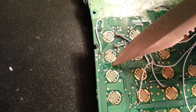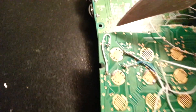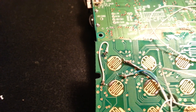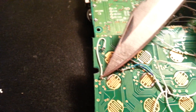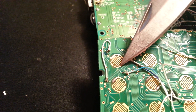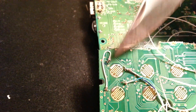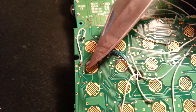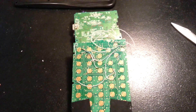The ground trace goes through here, through this trace, and then all the way up — it ends right there. I had to do another wire for ground from that trace down to this one, and that final one takes it to the bottom portion of this button, which I used for my A button on the Game Boy. So the A button for the Game Boy goes here, B there, back there, start there, and then the D-pad. That's all the wiring I did for this Game Boy.